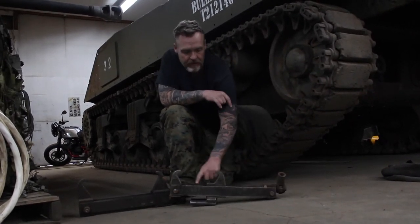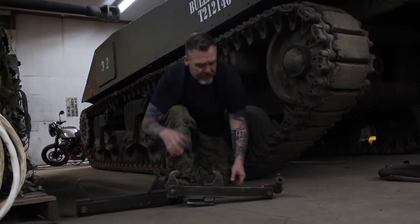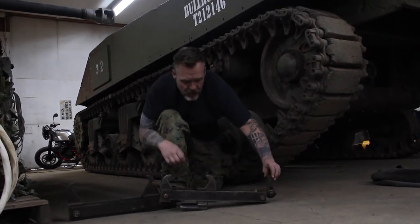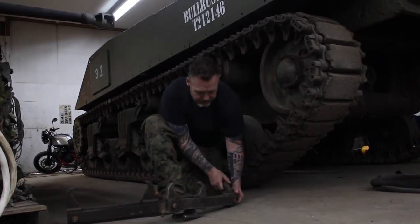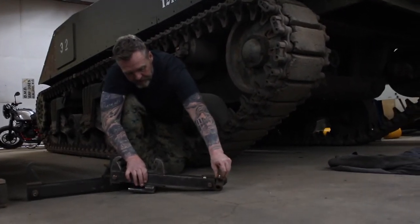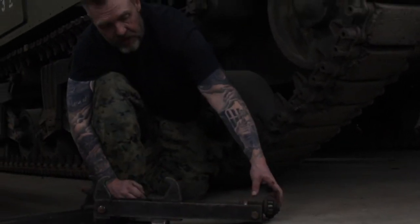It's a sliding clamp on a big worm screw, right here. And instead of using an actual tool attachment, they just put a bar in here, and this is actually a socket. So it ratchets like a socket, and then you just lift this little brass fixture and turn it the other direction. And then it'll lock in the teeth the other way to loosen. So this is how you tighten and loosen.